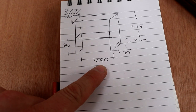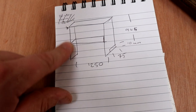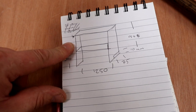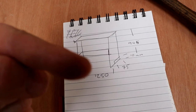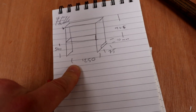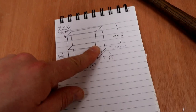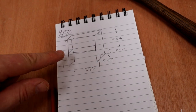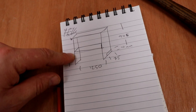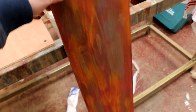The total width is 1250mm but that's the total width. These two side pieces are actually 20mm thick each, if we're going to use that piece of timber over there. So provided I use that timber, we're going up 40mm off the width, which gives us 1210mm. I've actually got another piece of scaffolding board that I use for the tables up in the brew shed which just happens to be 1200mm. So if I pinch 5mm on either side then we can use this to sit everything up.